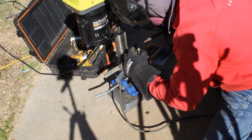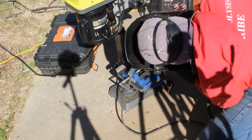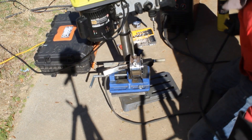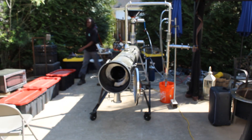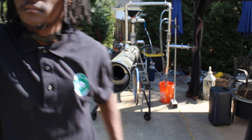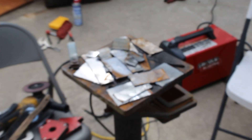What I'm doing here is working on the tri-clamp feed system, and I have to weld fittings onto it — these are going to be vacuum fittings. I can put in a vacuum gauge and also a vacuum line, so when we load plastic into the top valve you can actually suck out all the air first. I'll show that in more detail in a different video — this was just me getting that started.